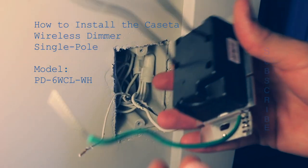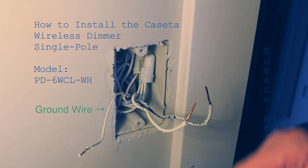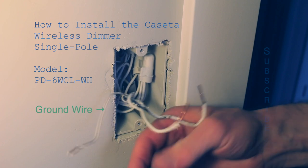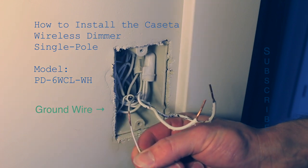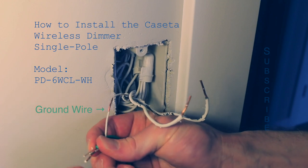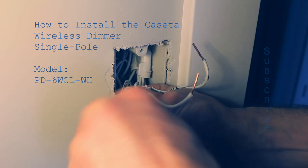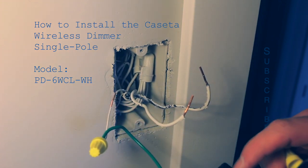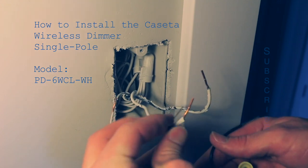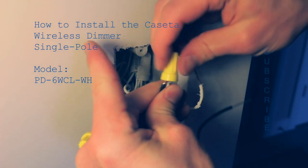This dimmer has three wires coming out. The only different wire is the green wire, which connects to your ground coming out of the wall — either a bare copper wire or another green wire. Take a wire nut, match the ends up, and twist clockwise until it's tight and you can feel the wires taking tension. That means they're connected well. Do the same with the other two wires, one wire to each of the wires coming out of your wall box. It's a simple one-to-one installation.